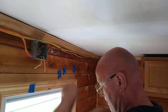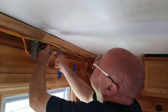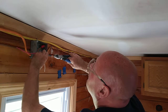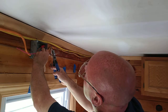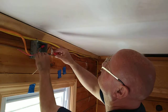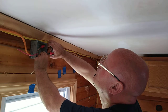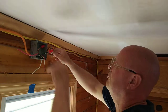We'll take our black ones next. Put the insulation so it's even at the bottom — see how the insulation is even at the bottom. Start my twist. Put it so it's even, then put my wire nut on. I'll work it with my pliers here. I'm not squeezing it too hard, just getting the teeth in there so that it gets a nice firm grip.